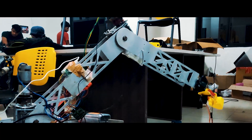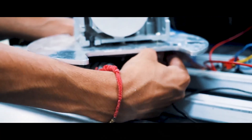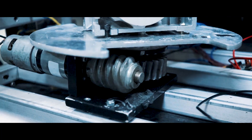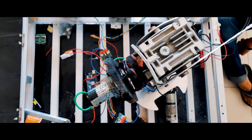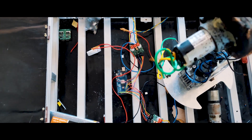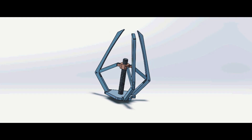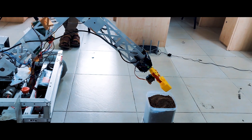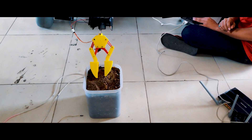Beach wheels are used to minimize overall weight and attain better traction. The robotic arm has six degrees of freedom with a reach radius of one meter. A worm wheel mechanism is used on the robotic arm for its high torque ratio and backlash prevention. For rotation of the arm, a turntable with worm gear assembly is used, powered by a DC geared motor. The gripper design is based on a three-fingered bird claw mechanism for better grip and accuracy, and will be changed before the science cache task for soil sample collection.